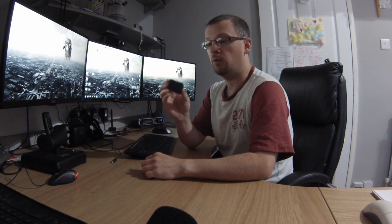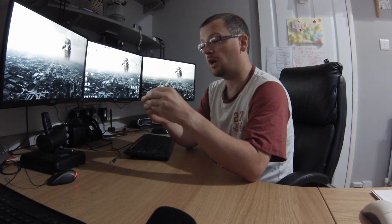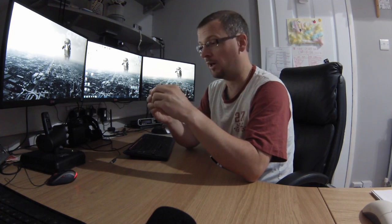So we've got a 9150 here, but first we're going to go through flashing it as if it was a 6050. Now the 9150s are backwardly compatible, so you can use either, but obviously you can't put a 9150 magnetometer piece of firmware in the 6050. It won't work. Nothing will happen, it won't break or anything, but it won't work. So we'll go through the 6050 setup first, the normal kind of non-magnetometer version of the software.